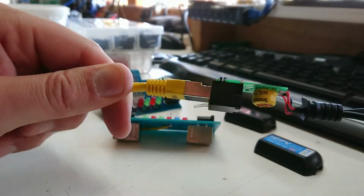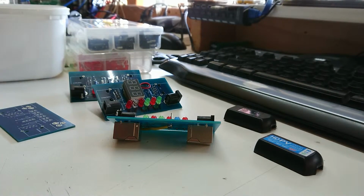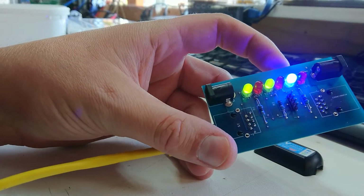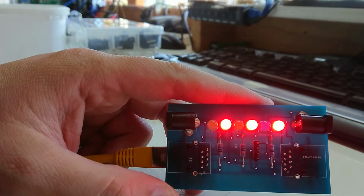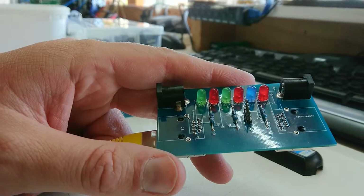And because of that, when we're running these, you get some problems occasionally with wiring, or you get some faulty cables. So the idea with these things is before we plug a camera in, we can plug one of these in and we can get green lights. There's a blue light on this one, but we can get green lights to tell us when things are okay. And if I, off camera here, swap the polarity and things are not okay, we get red lights. And that represents the 3 power pairs. So we know that things are wired properly.